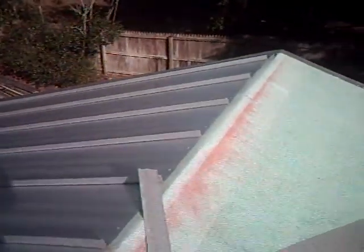Here's an example of termination — I just lapped it under, crimped it so it does kind of free-float, and put some caulk there. I didn't put any caulking at the ends — my guy never called for caulking on the ribs like Fabrel does. His rationale, after discussing it with him, is that in Florida's high-moisture environment you're going to get morning dew on the underside of these panels. I know that's a fact — I had chicken feed in a metal garbage can and sure enough the underside of the lid just rotted the chicken feed. So I figure if I don't put any caulk there, that moisture can continue down to the end and drip out. The whole roof is in peel and stick, so minor moisture that may fall obviously won't get into the wood.